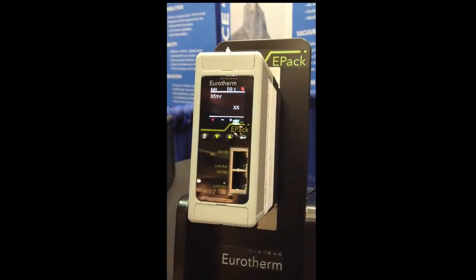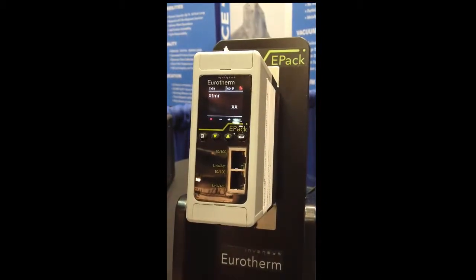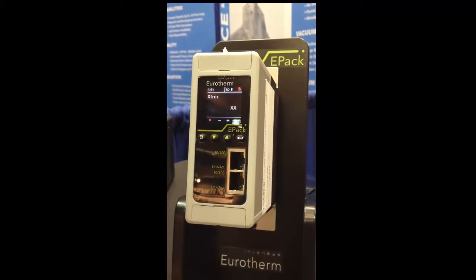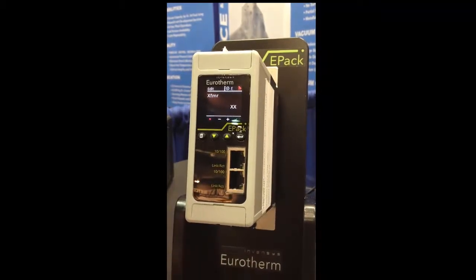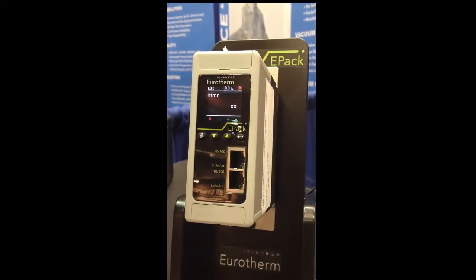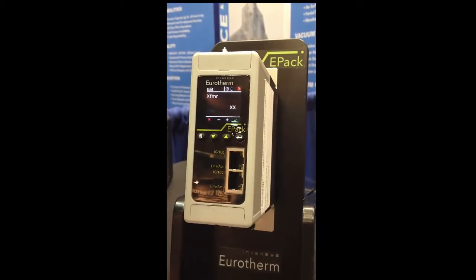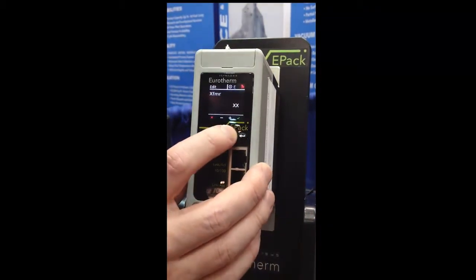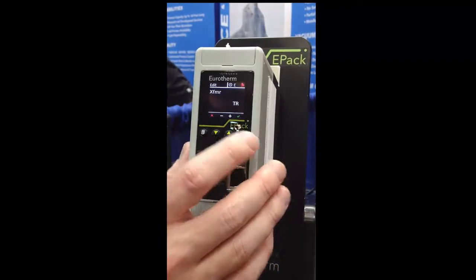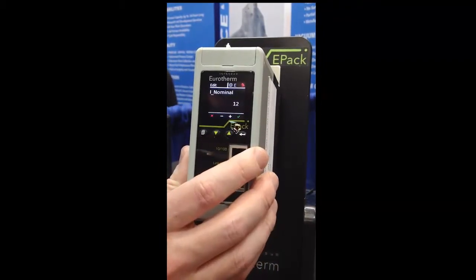This actually allows you to select, still about the type of load, if I want to fire directly to a heater, or if it's a transformer coupled load. So if there is a transformer in between the SCR and the load itself, that also makes some additional adjustments inside the unit. Okay. So here, transformer coupled load, enter.